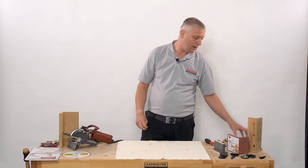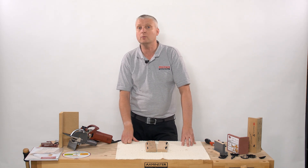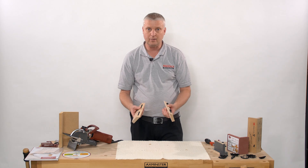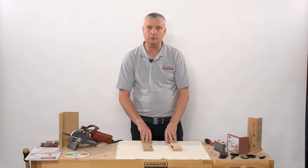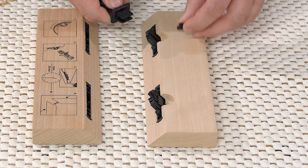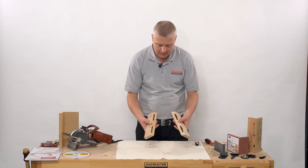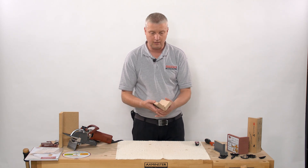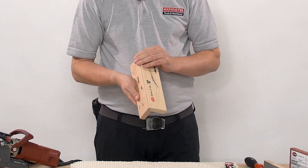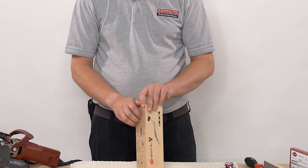If you're also looking to glue up and clamp — we all know you've never got enough clamps in your workshop, particularly when you've got batch production. By using the Tenzo fitting, we can overcome that. This is a self-clamping fitting which will pull together whilst your glue joint dries along the line. This is the Tenzo preload version, which is now the common standard one. Similar process — we're cutting the same holes, and all we're doing this time is inserting some little clips, and we miss out the drilling of the hole in the back. This allows us to insert the two pieces very close together with our glue line in place. We can make sure we've got a close position, then snap it together. The glue line will be squeezed up and that is then assembled. No need for clamping — ideal for difficult joints, repetitive work, giving you a strong, accurate location.